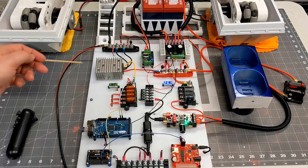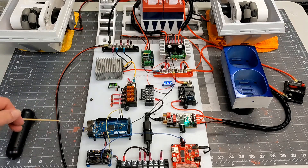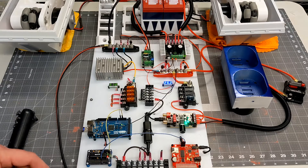I'm going to put a little more thought into the board that goes in R2. I'll probably make use of both sides of the board, putting things like the bus bars and voltage regulators on the reverse side and keeping components neatly on the front. I'll also reorient things so I have easy access to the volume knob on the amplifier and the SD card on the soundboard. I have an idea to have my board pivot inside the droid — vertical when operating and folded down for access to fuses. Hopefully I can get all of this put back into R2 within the next few weeks and then try driving it around.